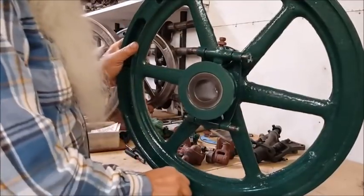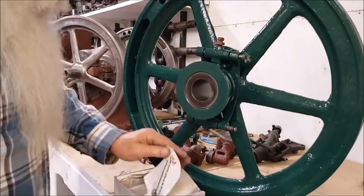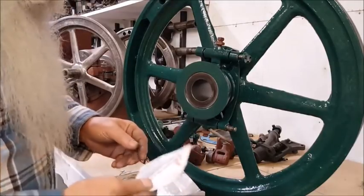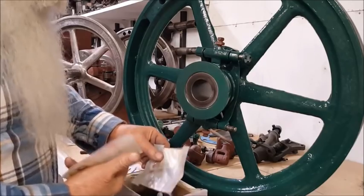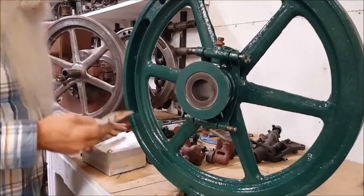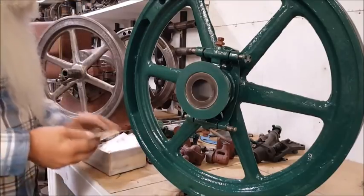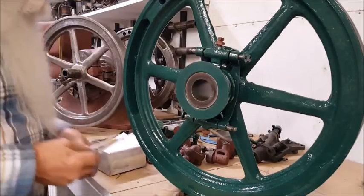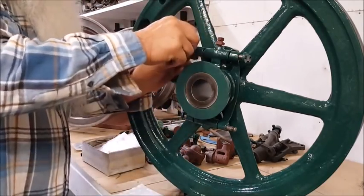So the way you do that is, I got these from McMaster-Carr, and I noticed these are arbor shims, 3/8 by 5/8, 31 thousandths thick, it's a little washer. These are just brass shims, the way they've got them listed there. This particular one is a 3/8 by 5/8 by 47 thousandths thick, and that's the same thing in a 62 thousandths. But you get them from their little spacer washers, and they fit, they're that size.